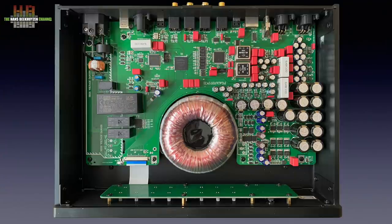Two screws and the lid can be removed. Directly behind the IEC mains entry we find some filtering followed by electronics for the auto voltage switching. The unit uses a linear power supply, which is normally only suited for one voltage, but like all Denafrips products I have reviewed, the Gaia has electronics that automatically switches from 230 volts to 115 volts depending on the local mains voltage. To power this circuit there is a small 20-watt switched-mode power supply. It is separated from the digital audio electronics, which is powered by a shielded O-core transformer.